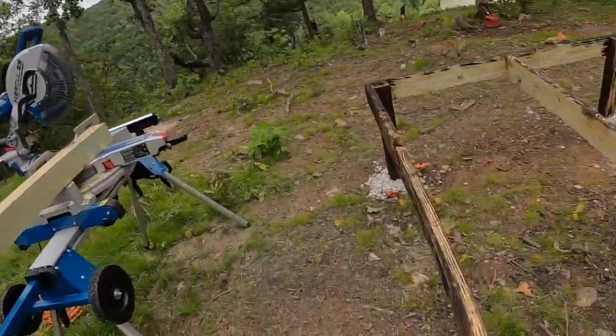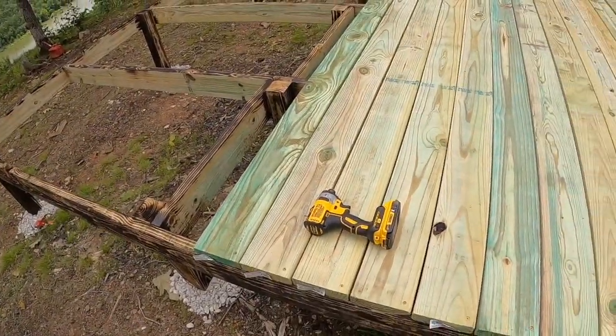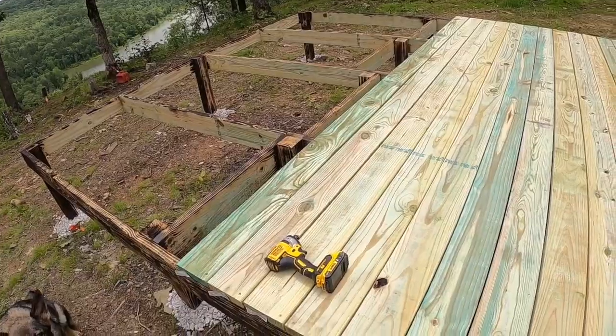I guess it's time to deck it. I took a long time doing these cross members thinking that you'd see through and see them, but I don't think you do — if I had it to do over I probably wouldn't do that again. But this is going on super easy. I'm doing three, four, or five planks at once just on the ends, and then I'll use a snap line to make sure I'm on it over here. I want everything to be uniform. I'm recessing my screws a little bit to make it nicer. This isn't the best lumber — I got it from Home Depot for $11 a piece, which was about half price, so it was really picked through and kind of marred up. But on one side it was usually good.